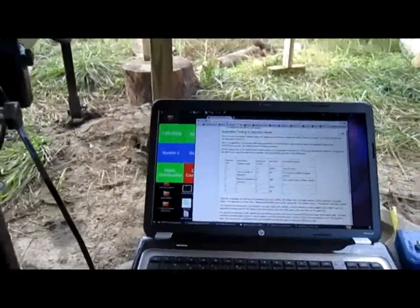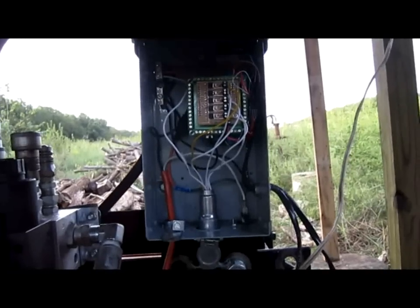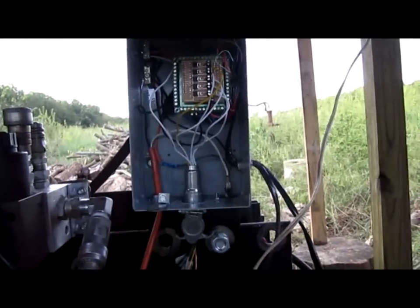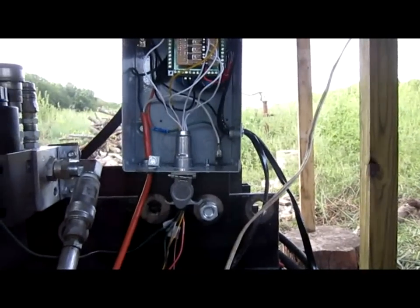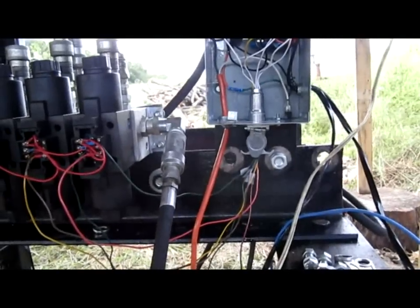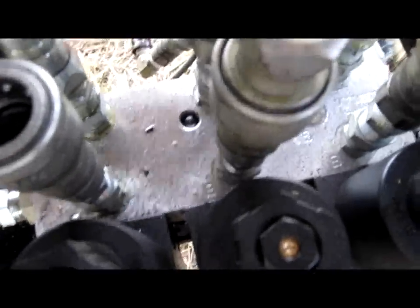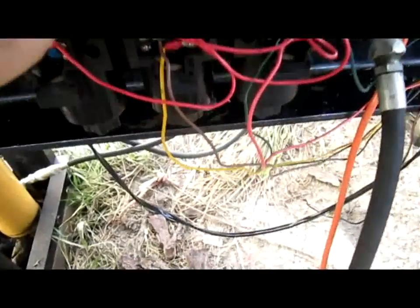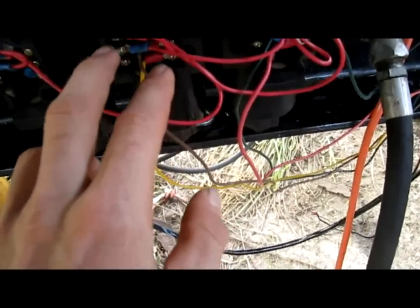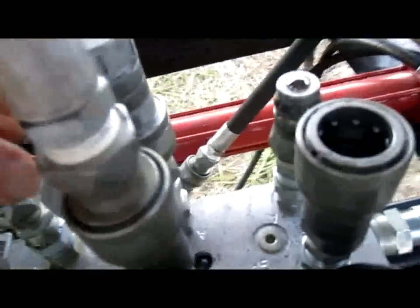This one will be for the shaker motor, which is taken off right now for testing. We've got the driver pins on the solenoid board corresponding to particular channels on the Arduino, and the motion is left and right for the secondary cylinder. We also need to notice what the convention is for the ports on the solenoid valve — if you've got the solenoid valve here.